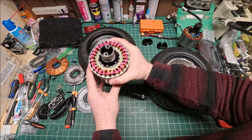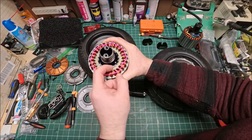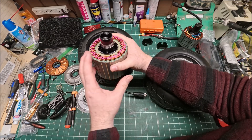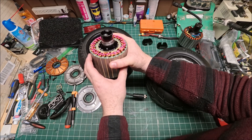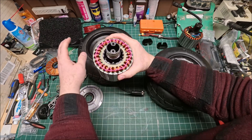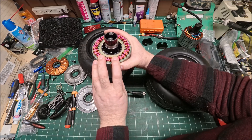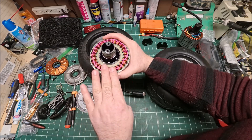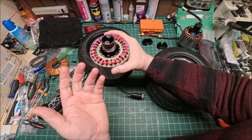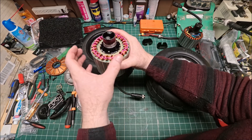What I did was use rope to tighten each winding and then chain it to another one — I saw them doing that on big commercial motors. For inrunners it's very important that the winding is nice and tight because they spin at high RPMs. All the motors on the OneWheel are outrunners, meaning the inner part stays stationary and the hub itself spins. For outrunners, tight windings are still very important — if the wires are splaying out, the efficiency will be slightly less, the motor will be louder, and it can make a humming sound because the loose wires vibrate in the magnetic field when running.